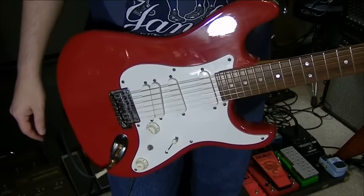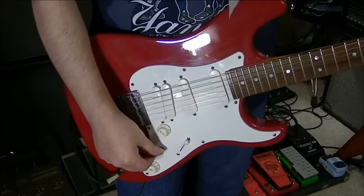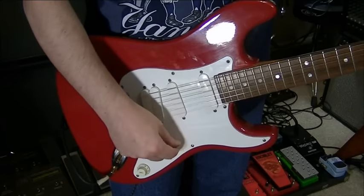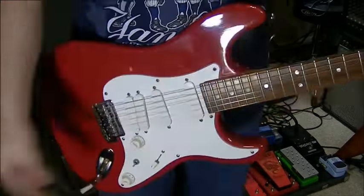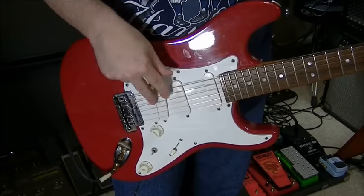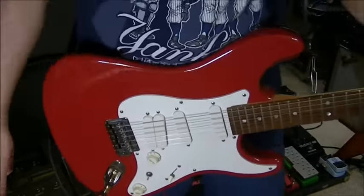Okay, your turbo switch. Position 1 is single coil. That is up towards you. In the middle, it's supposed to be a humbucker, supposedly. 3 is turbo mode. And all they say is that it bypasses this 5-way, which it definitely does. So it completely gets rid of, like, that's not even in the circuit anymore. And it's supposed to send, honestly, it's supposed to send this past everything and straight to the jack. But it doesn't. It never has.